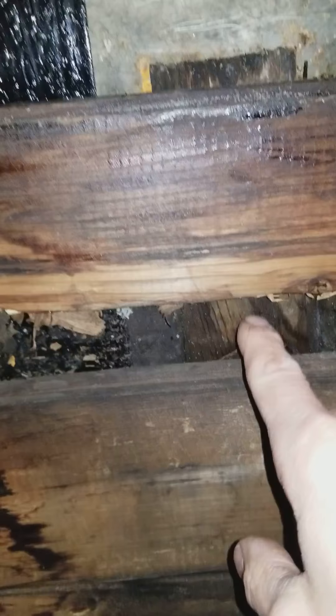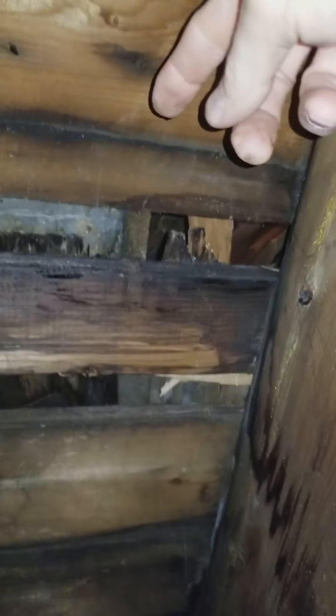There's water up as high as where the valley would dump. Where the valley dumps onto this secondary roof, there's already water showing itself. You can see the ice and water there, ice and water there, ice and water all through that — that's the valley, the upper valley that comes down.